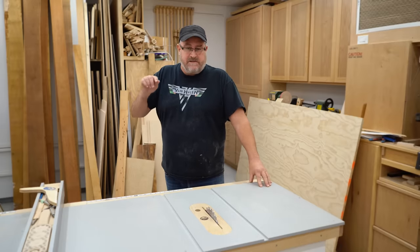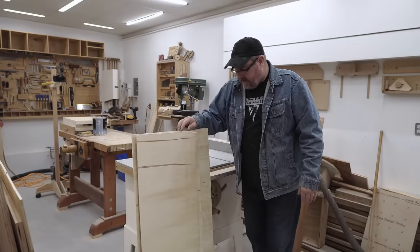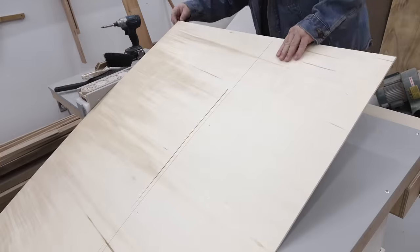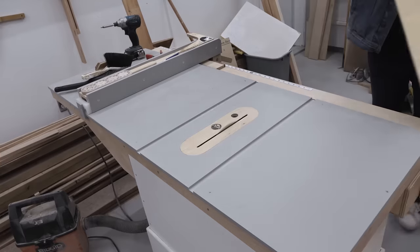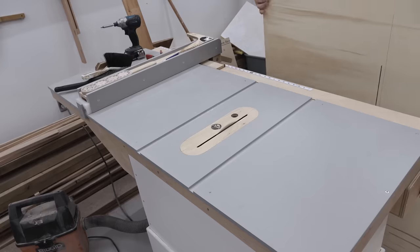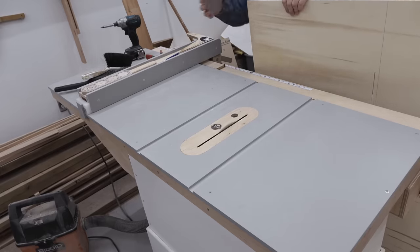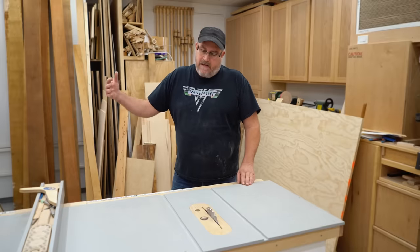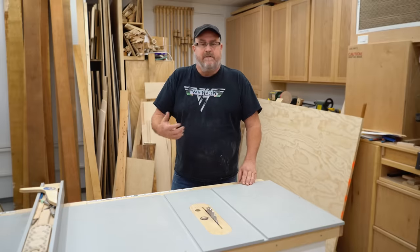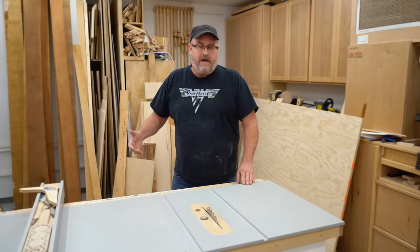For instance, there was a staple sticking out the edge of one sheet. You might have seen that I ran into a problem when cutting this one — there was one of those plastic staples sticking out the side of the sheet, broken off and sticking out about a sixteenth of an inch. It pushed the sheet out away from the fence. I didn't notice it and didn't check for it. It got hooked on the end of my fence, pushed it off to one side, and messed up the cut.